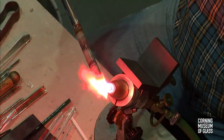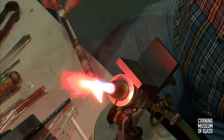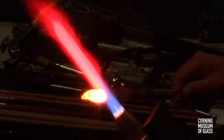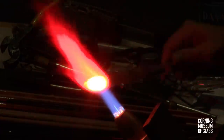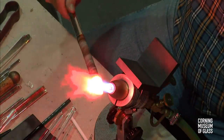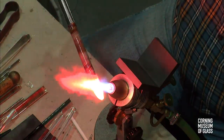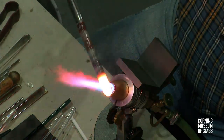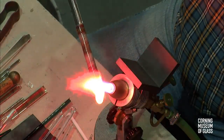Remind me again of the temperature range that this could be. Okay, so the temperature ranges that we're working at with this sculpture: we are not letting the glass really get below 1,000 Fahrenheit. The torch at its hottest will run up around 4,000 Fahrenheit. The glass never gets up to that temperature, though. At its hottest, he maybe gets it up around 2,700, and that's when it's really looking white hot and flowing about as fast as this glass will flow.